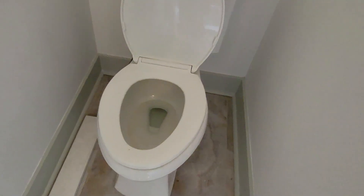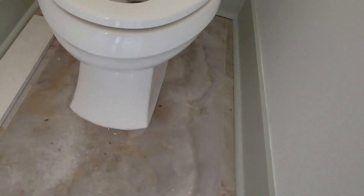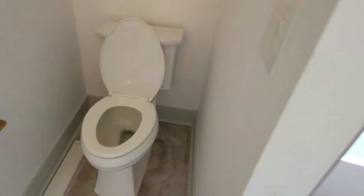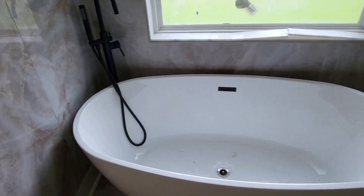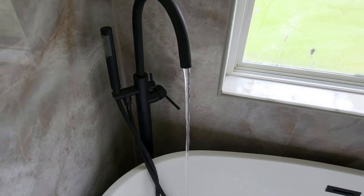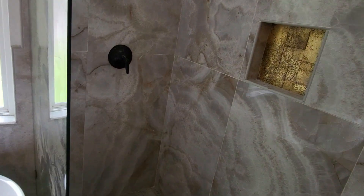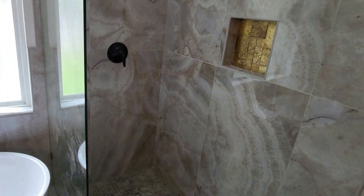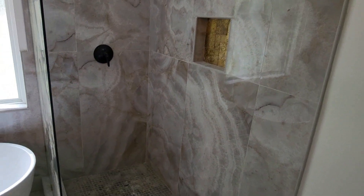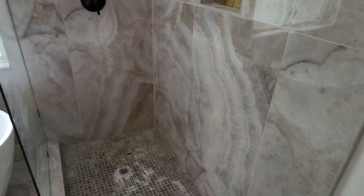There's your water closet — I flush it and check for any leaks at the shutoff valve, making sure it's caulked and sealed around the base and no leaks at the tank. That's the bathtub — turn on all the fixtures and make sure everything is working. That's the shower — I've already turned it on and tested it; I won't turn it on again for the sake of the video camera.